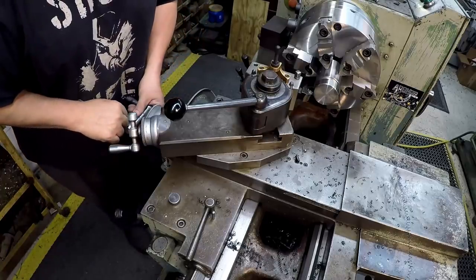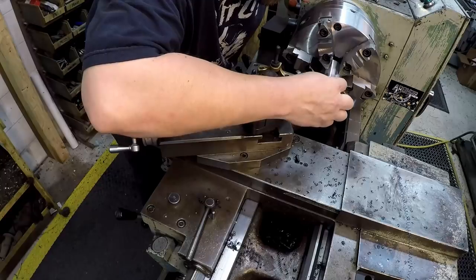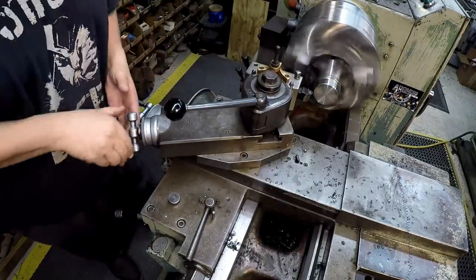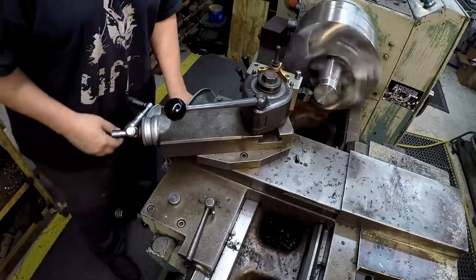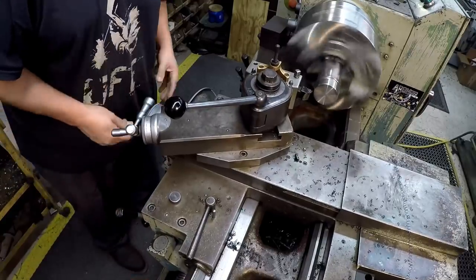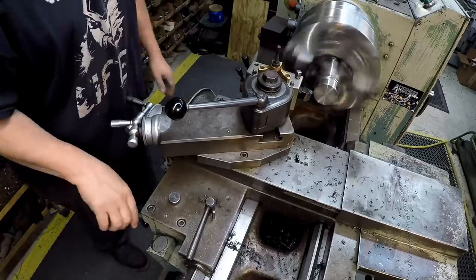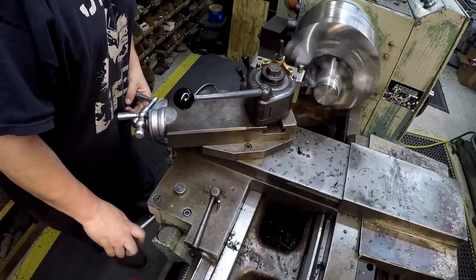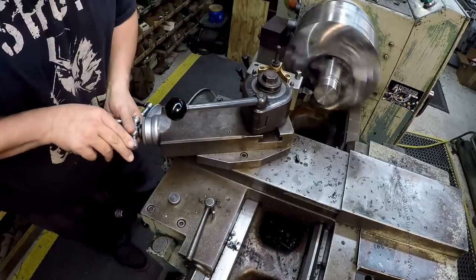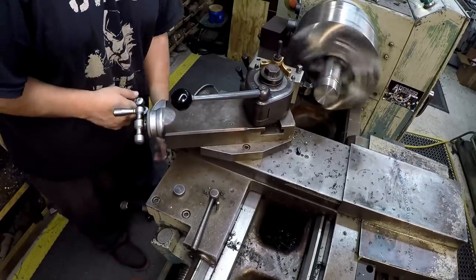Let's check our pitch. Already got everything preset right here. And we look pretty good right there. Running 370 RPM. Quick draw McGraw. You don't really have to do quick draw because I got an undercut there. Gotta make sure you disengage so you don't crash.